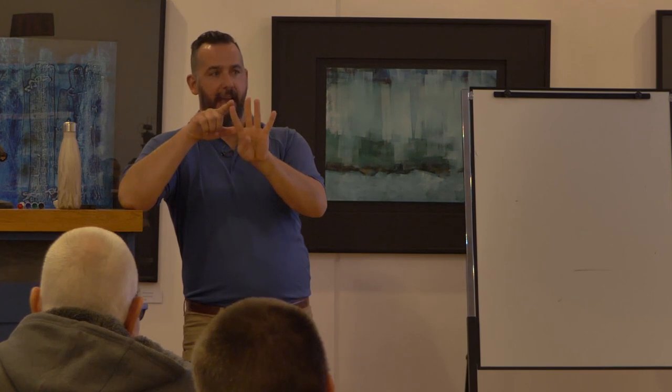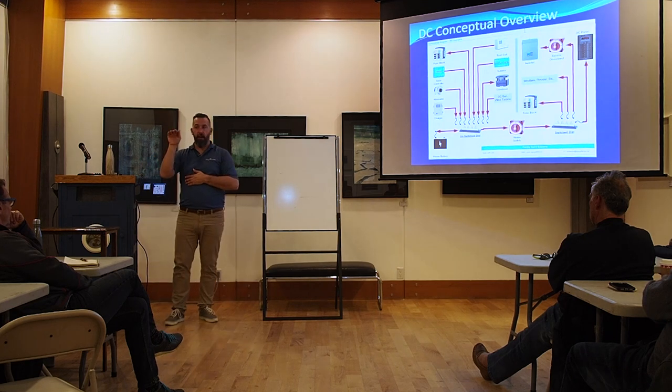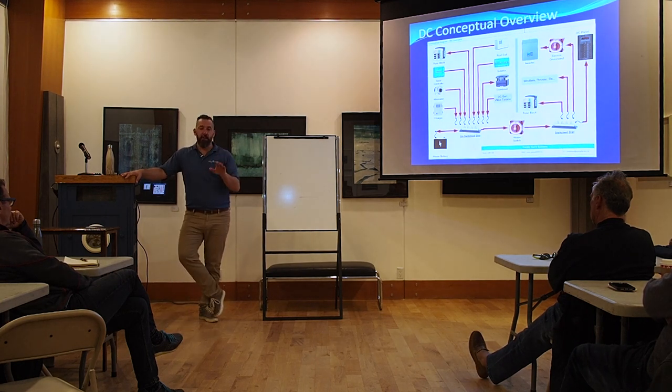You give me four numbers every hour on the hour: time, volts, amps (should stay steady at about 5 amps), and amp-hours from your amp-hour meter. I want to confirm you actually recorded each hour and that there are no surprises — after one hour it's 5 amp-hours, after two hours it's 10. Use a steady load like a light bulb, not a fridge which is intermittent. After the discharge period you'll find out what the actual capacity is — whether you're at 95%, 70%, or 30% of the rated spec. That is the only true way to know your real battery capacity.